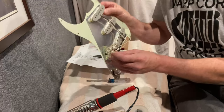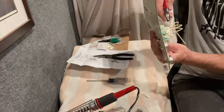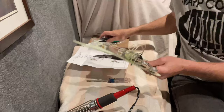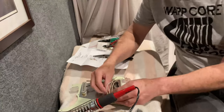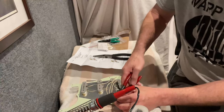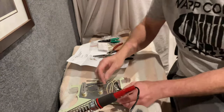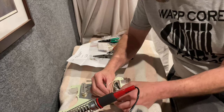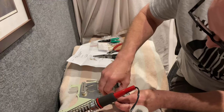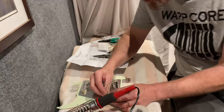Just double-checking my work as I go. It's got a good bead of solder on it — not huge. Get rid of my excess wire. This allows me to measure things up as I go. I love working with this cloth-wrapped wire because the wire itself is pre-tinned — you trim it back, push the cloth back, and continue on rather than having to strip each wire each time.